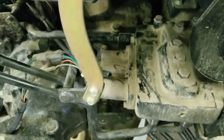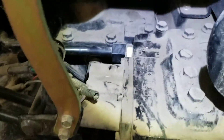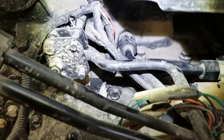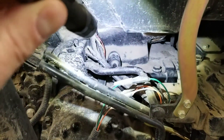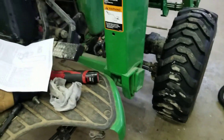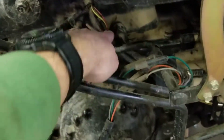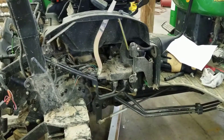Let me grab my flashlight to really identify it. There's nothing that really identifies it — I was trying to see if there were any stampings or anything, there's not — but it's just kind of attached to a little 90-degree bend that goes into the housing. To hook up your third function, you hook up one hose here and that goes up to where you put your diverter valve, then there's another hose coming back from the valve going back into the housing. That's basically how the front third function kit works.